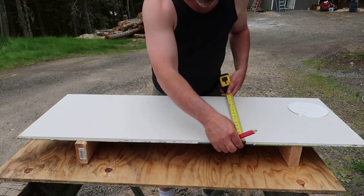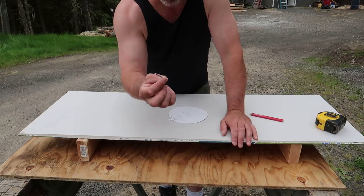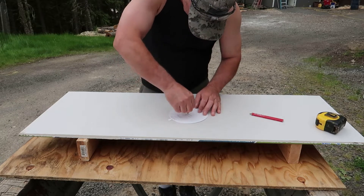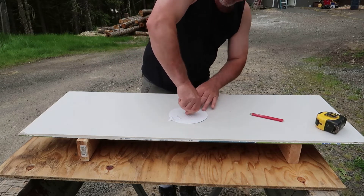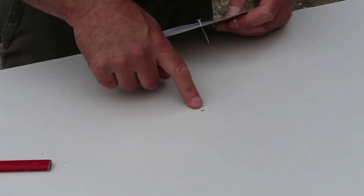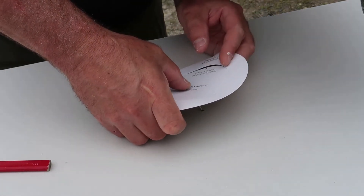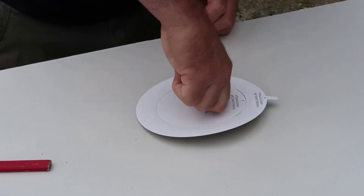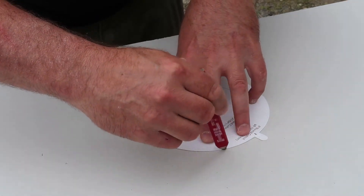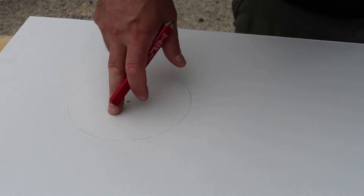First, pretend this is your ceiling — you're going to locate and mark out where you want your lights to go. What I used when I did the holes in my ceiling: I just used a regular nail and roughly found a good spot for center — for me it didn't have to be exact center. I pushed it through the drywall, found my marks after measuring, pushed the nail right on my mark into the drywall where it holds up, then put pressure on it with my hand, took my pencil, and drew an outline around it.